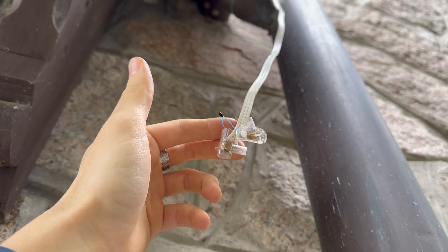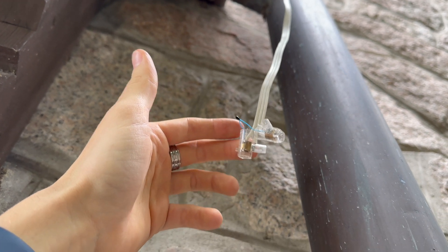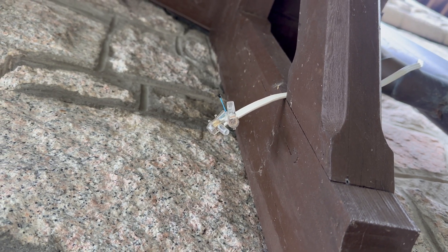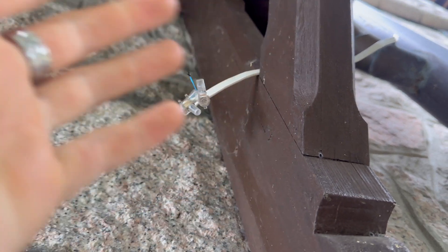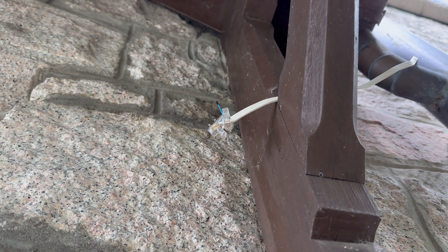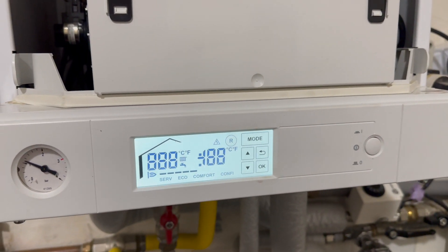Please mind that you have to position the thermocouple on the north or northwest side, otherwise the temperature reading will not be reliable. You also have to protect it from water and other elements, so it's better to place it in a closed box.